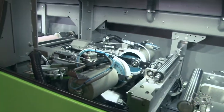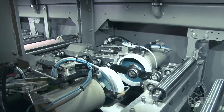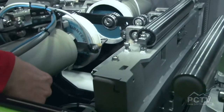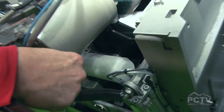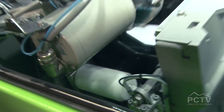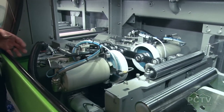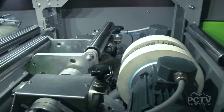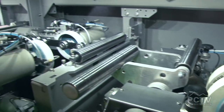We've got our trim disc unit, which is the same unit as we have over in the trim jet, but a little bit more automated. If you can see down where my finger's pointing here, those white cylinders are the digitally controlled bevel units. So besides the 7 presets that we have for bevels on this unit, we also have anywhere from 0.5 to 5, both side and base, that we can control just by the computer.